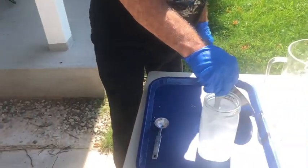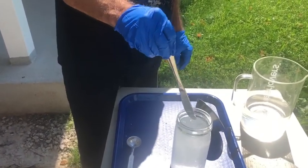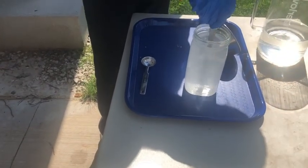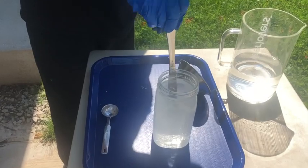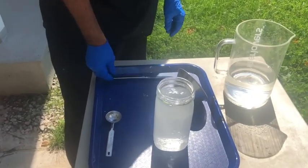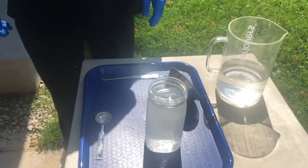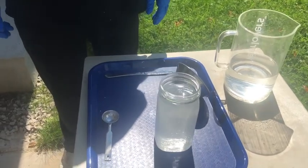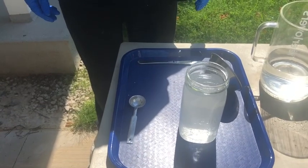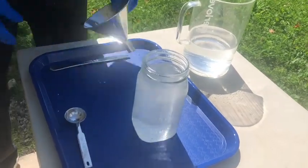If the lye mixture gets weak for some reason, first of all, there has to be a reason because the lye is supposed to stay in the machine. But if it does get weak, you can just throw in an ounce or two more of lye, and it'll probably work just fine. I'm still using a mixture in one of my electrolyzers that I mixed in 1986. The lye doesn't go bad, and it's supposed to stay in the machine. So that's another reason I can offer a lifetime warranty on my machines, because I know they're going to last for decades.